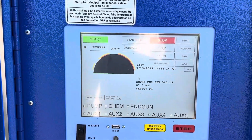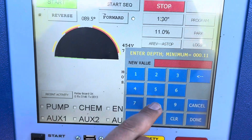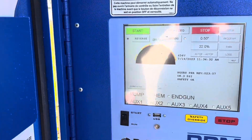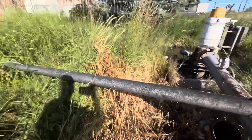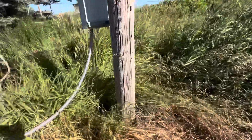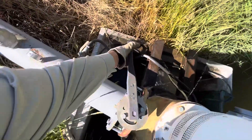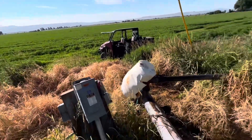This is one of those newer panels I was telling you about — a nice new panel, a lot easier. Let me set this up so when I turn it on it will do exactly what I want. There's a big valve under here they had to close down when they ran pipe — they needed to put extra pressure back into the canal so they don't blow the main line. Then there's a big valve on the pump that closes it down, and we want to open it all the way so we get all the pressure. That pivot needs as much pressure as it can get.